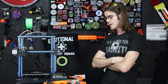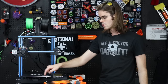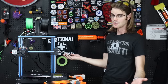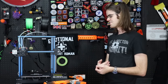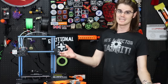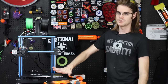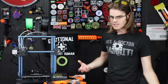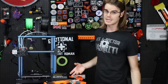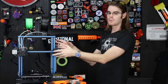Things that I don't like about it: the bed is incredibly cheap. I have damaged the bed in the center, so I'm printing on the corners. I'd like to upgrade the bed, which is cheap and easy because it's essentially just an Ender 3 clone. The other thing that's a little upsetting is the interface is on a green LCD with really high latency — sometimes you click on the wrong thing, or you enter through the menu and it doesn't give you exactly what you want. So sometimes you'll program in a decent blend and then you won't get that blend.